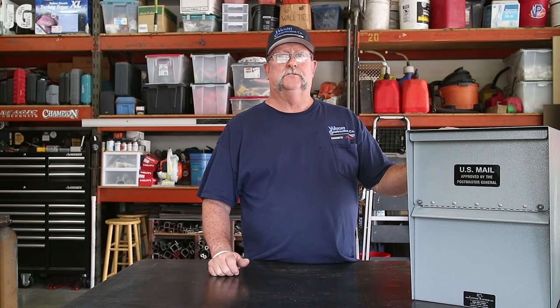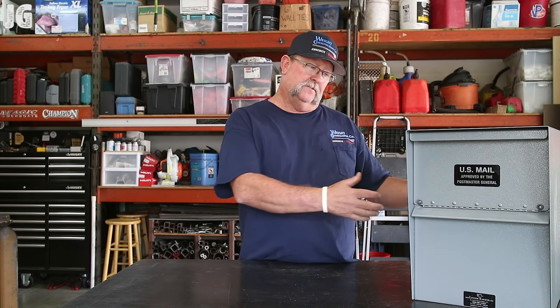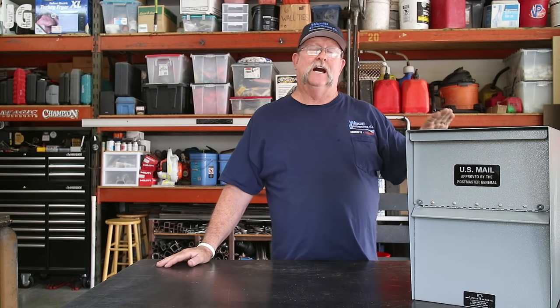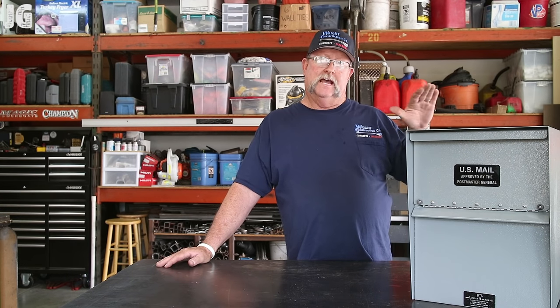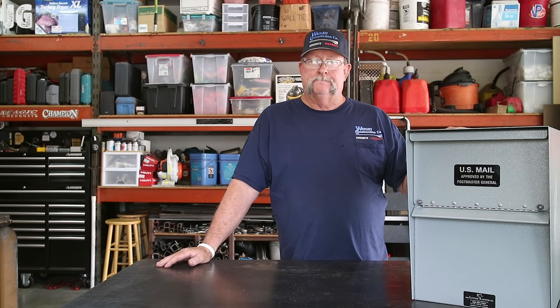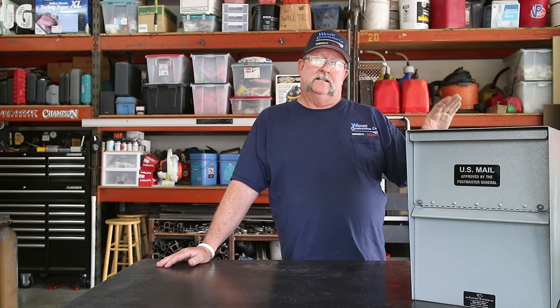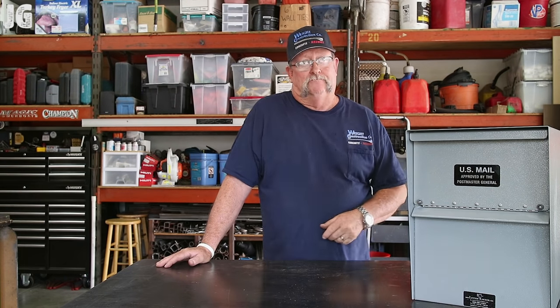We still wanna veneer this thing with stone, so I'm going to build an angle iron frame off of this metal post that's gonna surround this thing all the way up. That's gonna allow me to bolt some Hardie backer board to it, and then I can go ahead and veneer it with stone and cap it with stone, and the customer ultimately is going to get what they originally wanted, and we're also gonna satisfy the homeowners association. So, with that said, I've been to the metal supply store, I've picked up everything which I think I'm gonna need to make this work, so let's get started.